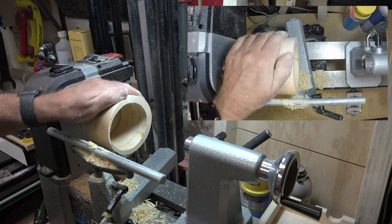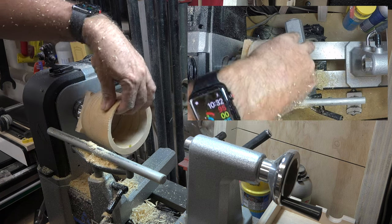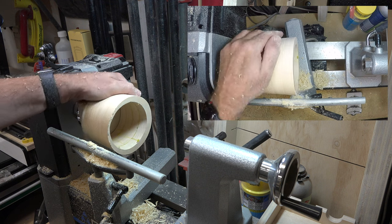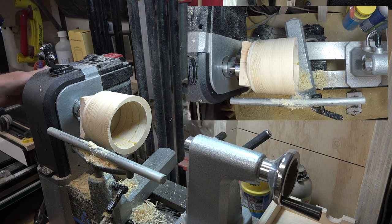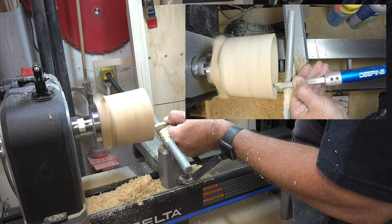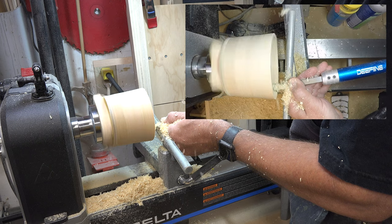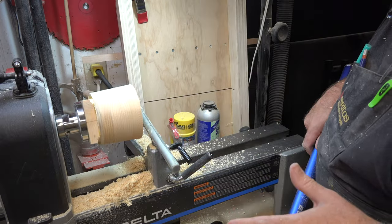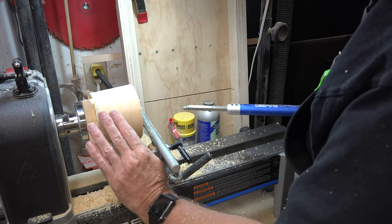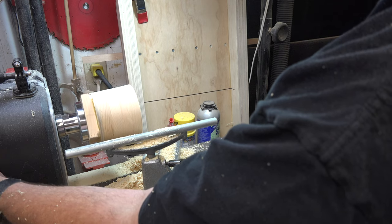With that, the outside is turning true. Now I want to turn our attention to the inside, but we do have an awfully thin wall here — I wonder if that's going to blow out, but we'll play it by ear. Let me switch around to the inside of the shaving bowl and get the inside leveled out. We've got the inside pretty much leveled out, and now we're going to level out the top as well, then do a little more work on the outside to smooth it out. From here we're going to give the entire thing a good sanding inside and out, and once sanding is done we can remove the face plate.